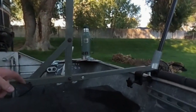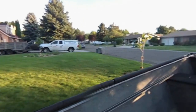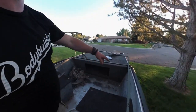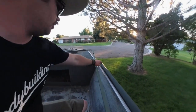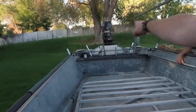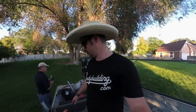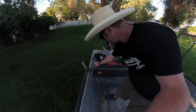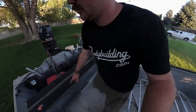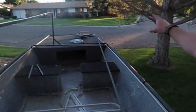And we're gonna stabilize this. We're gonna put bolts in here and make this sturdy. And the same on this side over here. So this frame sits one full square all the way across. Clamp there, and clamp there. Now my blind frame is going to be about 8 feet from this edge to here. And from here to the front where my platform is, 13 feet.